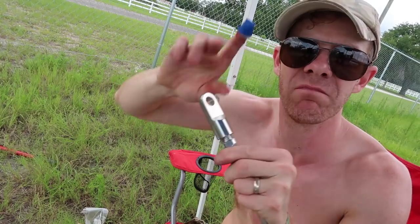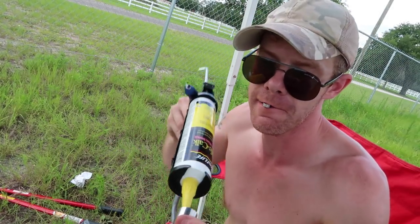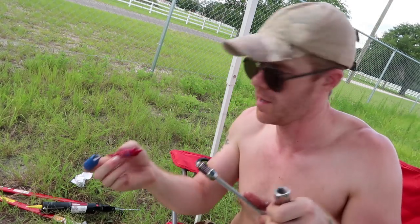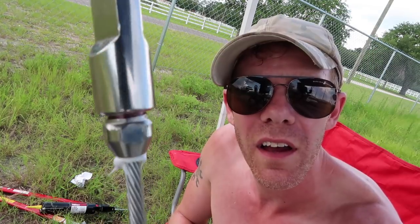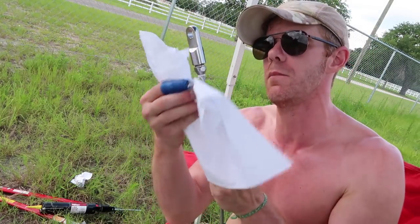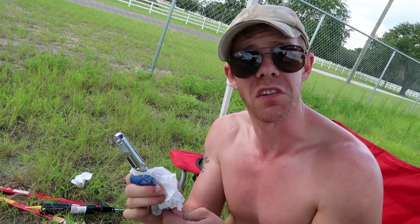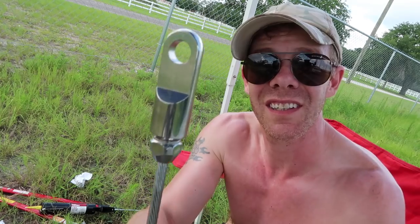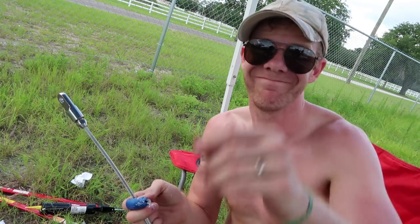So we're going to put it on and then take it back off. Put a tiny little bit inside the eye terminal, and you put this little mini cone in, put a bit more caulking in there, red Loctite on the threads, tighten everything down. Clean up the caulking that is squeezed out of the bottom fitting, and finally clean up any blood that may have gotten on the fittings, the wire, your tools, or your person. Then you have a Sta-Lok eye terminal. Da, da, da, da. Now I just have to do this 3 more times.